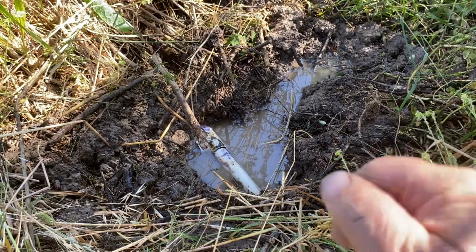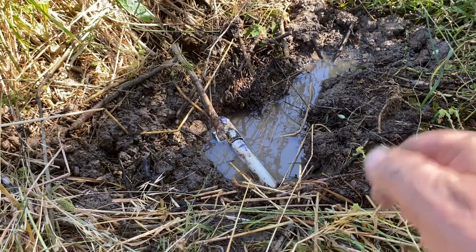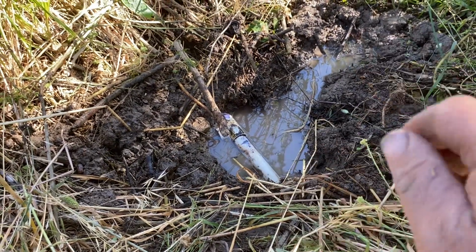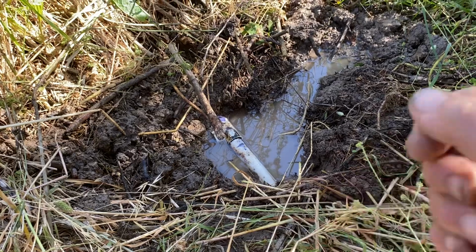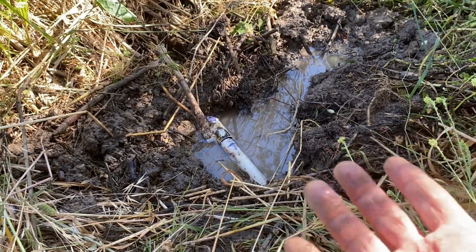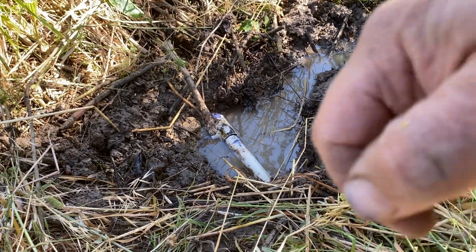15, 30 seconds. And the way I'll do that, I'll do a row of like 15 rounds, just because it's got plenty of primer. We're starting with primer. You'll put the primer on and you'll just turn it. You'll spread it around, but you'll keep doing it, even after you know it's got plenty of primer, just to waste time so that it gets into the pipe. Same on the other piece.